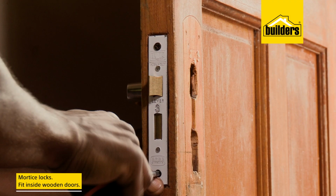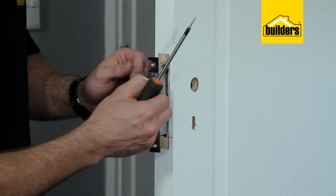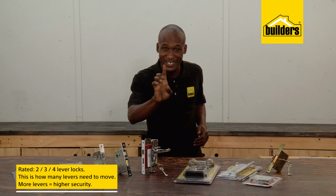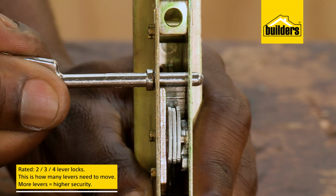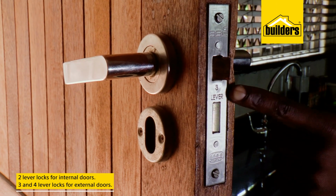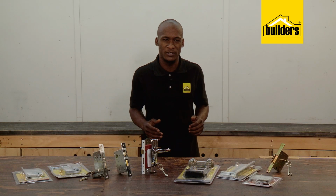These mortise locks are designed to fit inside wooden doors in a hollow that has been chiseled out. And Dave showed us previously how to measure and chisel a mortise. Check the link below. These locks are rated as 2, 3, or even 4 lever locks. And this relates to how many levers need to be moved by the key inside the lock before it'll open. The more levers, the higher the security level. And generally speaking, 2 lever locks are used for internal doors like the bedroom or bathrooms, and 3 and 4 lever locks for external doors. Mortise locks all have stamps on the faceplate that tell us how many levers there are, which is the level of security. Have a look at the locks in your house.